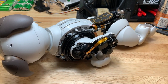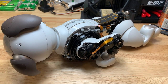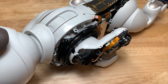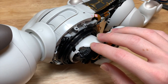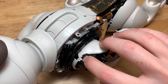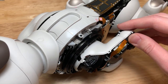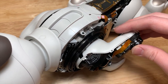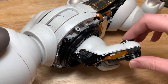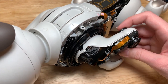One of the questions that I get asked relatively often is: why do the legs in the ERS-1000 fail at such a high rate and so frequently? With the dog partly disassembled from a previous exam I did off camera — I didn't bother putting them back together since I didn't have the parts to fix the issue at the time — we can start to see the issue right here. In this plastic part that attaches to the lateral hip gearbox, we can see there's a crack running through it, and that results in loose movement on that axis, and when the dog puts a substantial amount of weight on it, it can no longer support that and the leg just pushes itself outward.